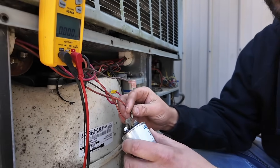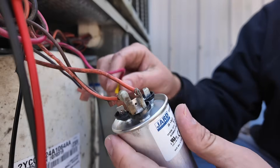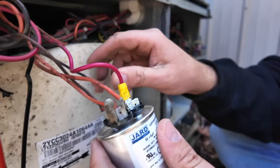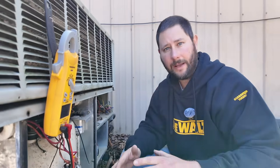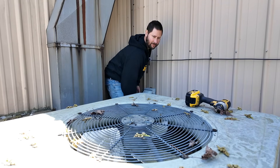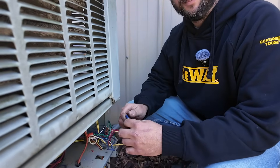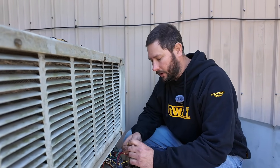Now I'm going to leave this hanging for just a minute — definitely want to strap that before you leave. Make sure you have some metal strapping in your truck or service van. Let's put those screws in for the fan motor and plug in the disconnect. Now instead of waiting for the thermostat's five-minute delay, I'm going to jump out the cooling operation by taking the yellow wire and connecting it with the red wire — connecting R to Y.